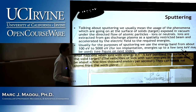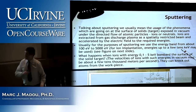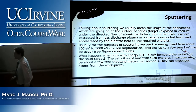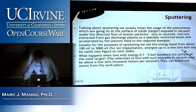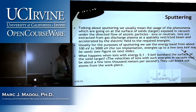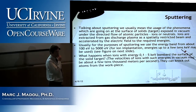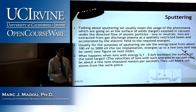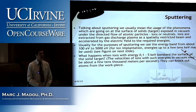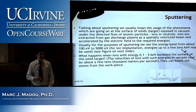Do the argon atoms keep losing electrons? Well, they also, let me just a second. No, the answer is no. You will reach an equilibrium at one point where there's an equilibrium between ionized and neutrals. But there's a quasi-equilibrium between the number of electrons, cations, and argon neutrals that establishes, depending on their disappearance rate. Generation rate minus disappearance rate will establish the exact concentration of each species.